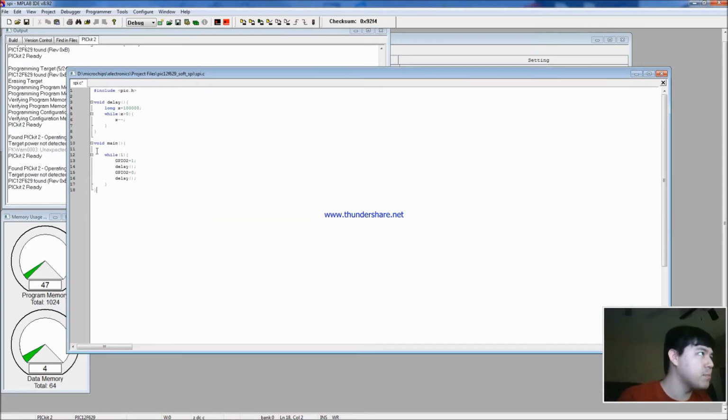Okay, so in my excitement, I found something very important. We need some configuration for the microprocessor first. So for now, I'm just disabling comparators. We're not doing anything with analog sensing or anything like that, so we don't need them. And for the tri-state input-output, we need to set which pins are going to be outputs. So for now, let's just set all the pins to output. There is a caveat to this, but we're not going to actually run into it for now.